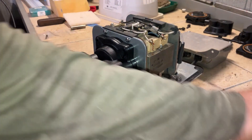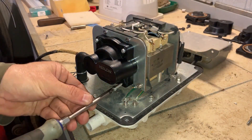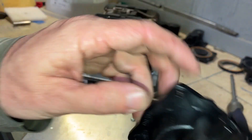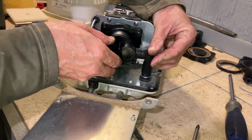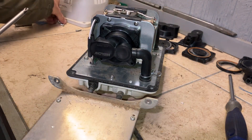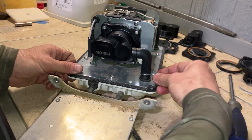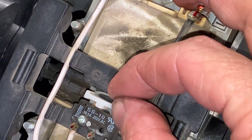Put it over the top and put your four screws in. Put your clamp back on the hose, then turn around and do that on the other end as well. There's a notch cut out here and a notch that sticks out here, and then this goes on your hose. Put the hose clamp on. Now we've got the diaphragms on each end and the switch set back, so this pump will be ready to come on now if you plug it in.